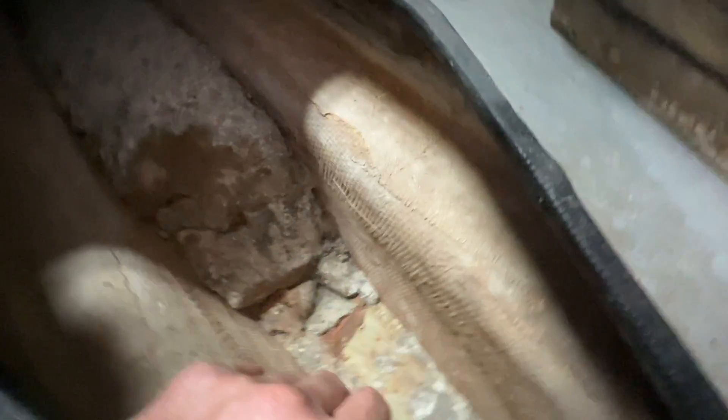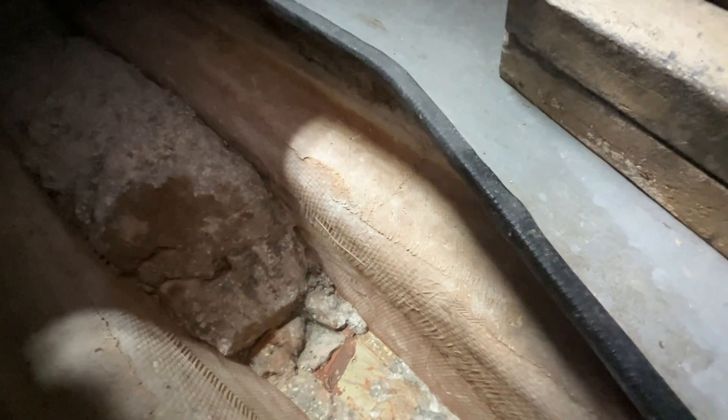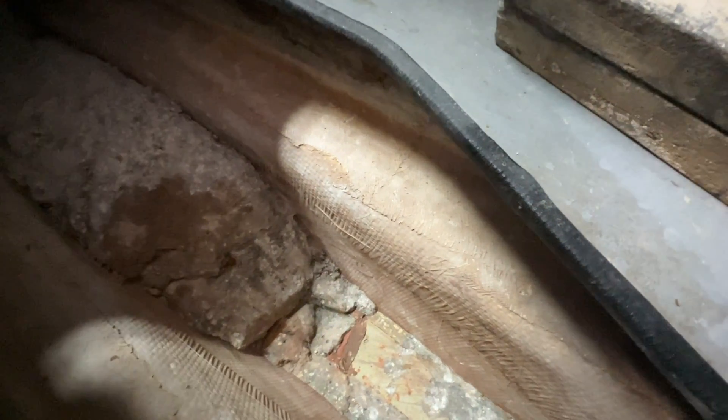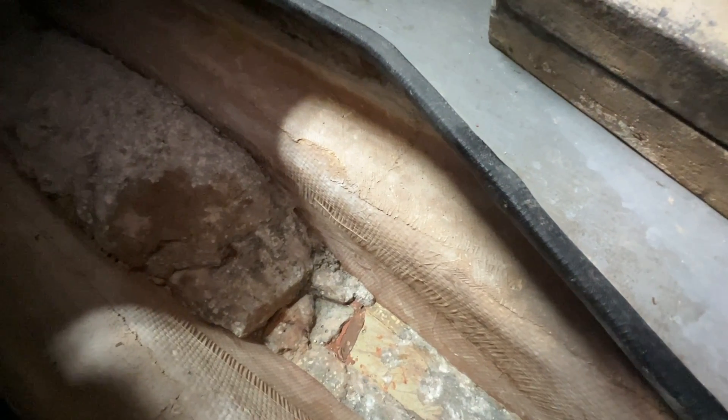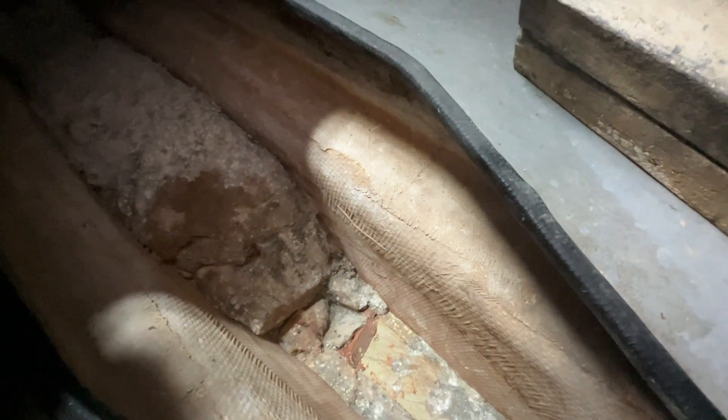What I'm going to try to do is pour this concrete back level with where the hull takes off from the keel right here. That way I can lay fiberglass just straight across and bond it here as well as up the stringers to reinforce this whole area and seal it all off. That should put me, with the concrete floor, between one and one and a half inches lower than it used to be — which would be nice to have just a touch more foot room. And that'll concentrate the ballast weight lower without sacrificing structural integrity.